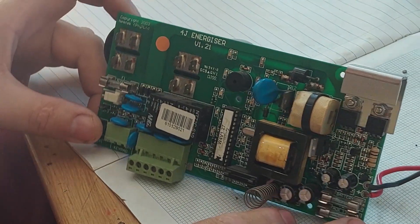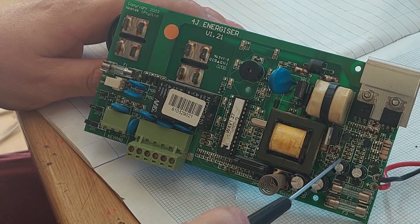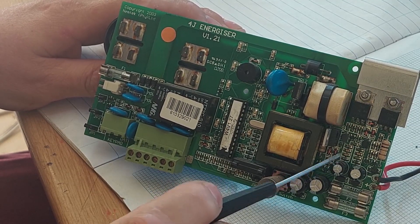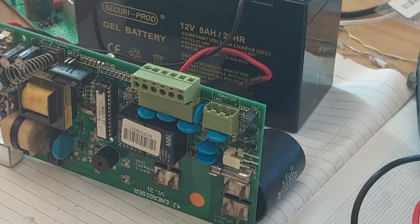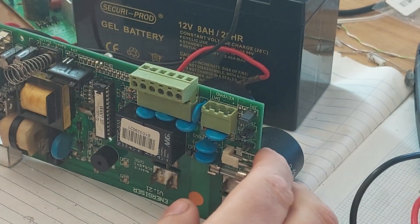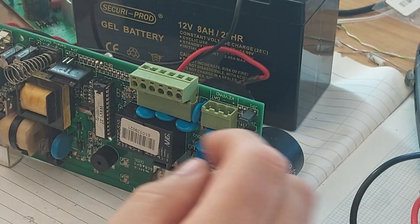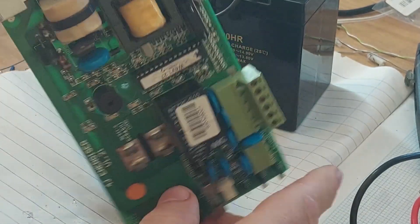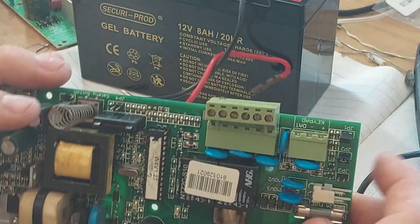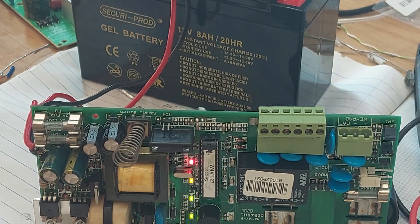Now we've got the energizer PCB in the lab. I notice this capacitor is bowed or domed on top — it's pushed out from high pressure and looks swollen. We are definitely going to replace that capacitor. I've pulled out those two faulty capacitors. The faulty ones were 16V 470µF. I've got 35V 470µF replacements — I hope it's not going to cause a clearance issue, but it shouldn't. I've put them both in. Let's power the board up now off battery and see what happens. Hey, we get some nice bright lights now — that's nice.